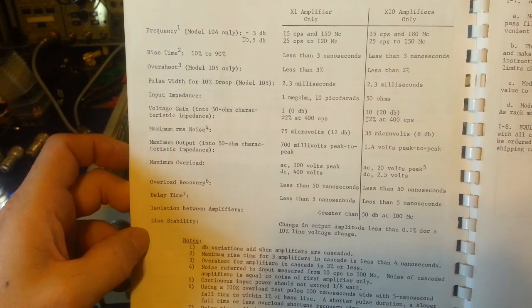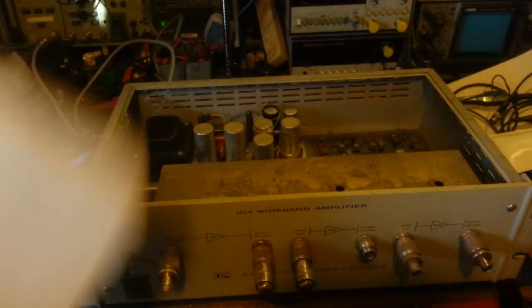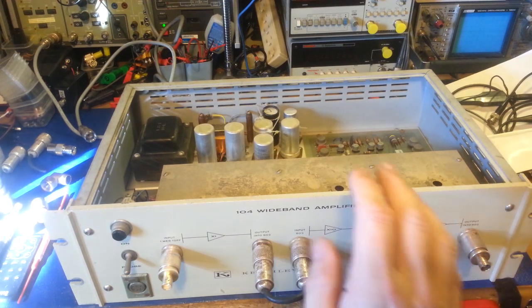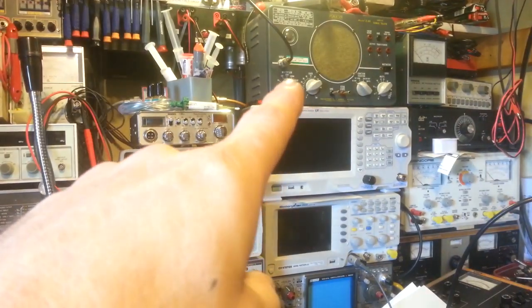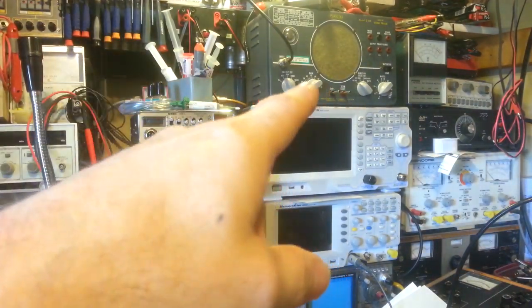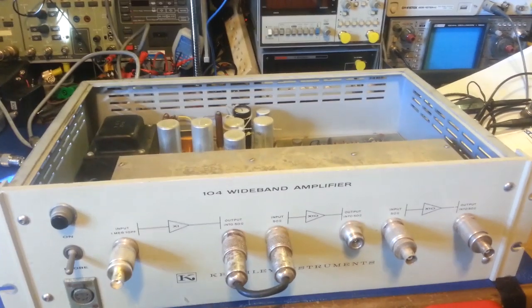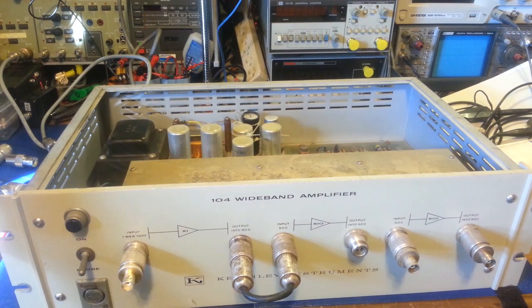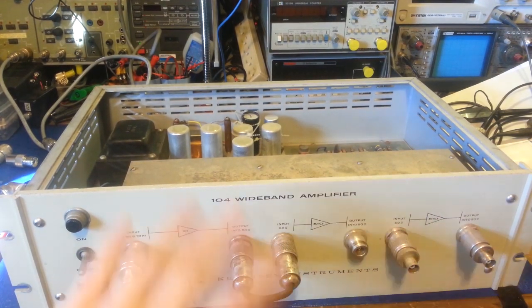Pretty good specs for an antique, basically. I'm not going to be using this to take quantitative measurements - I just need it mainly for signal tracing. A lot of times with tiny signals you can use something like an old signal tracer, but it's kind of hard to do that. This is just so nice - I'll be able to hook up a scope probe here, hook into the circuit, not have to worry about loading it down, and then I can amplify through two stages.